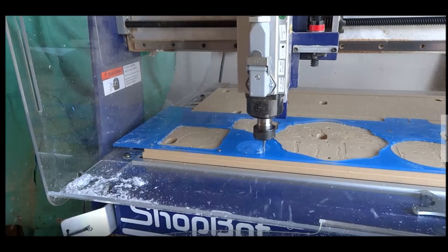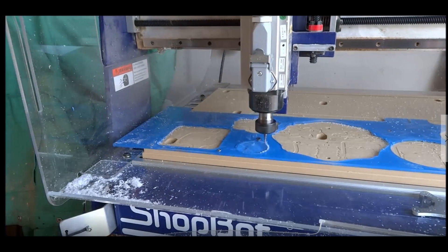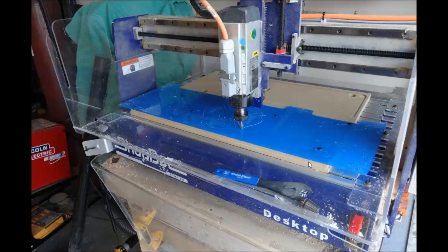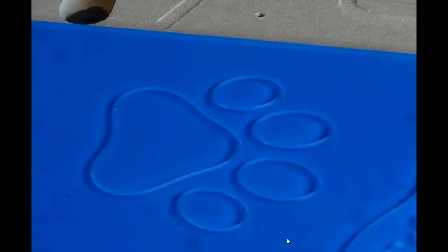When the eagle head finishes up it has a really good finish. I'll hold it up to the light — it appears blue because the protective coating is still on the backside of the plastic. Once I peel that off and hold it up to the light, you can see that straight off the machine it comes out pretty clear. Using different finishing techniques you can find online for acrylic, you can have this thing smooth and crystal clear in no time. The top protective coat was removed during cutting so it wouldn't get spun up into the spindle.